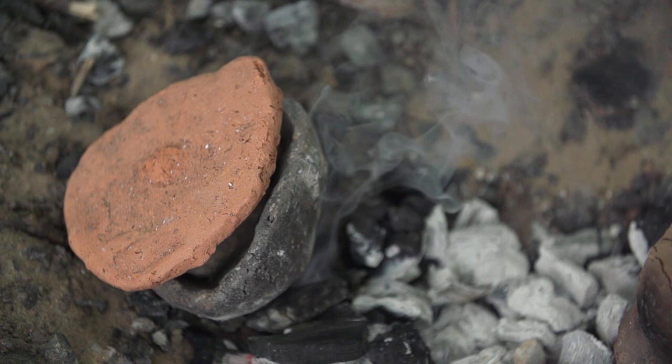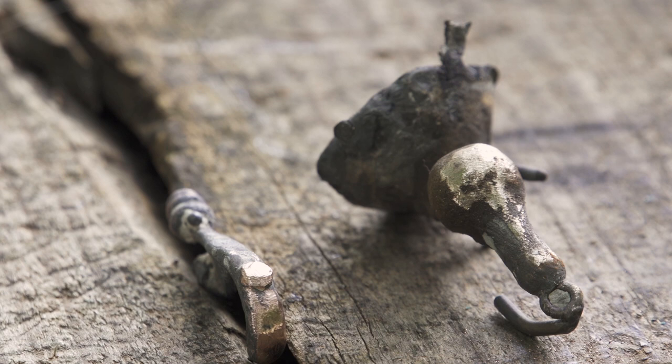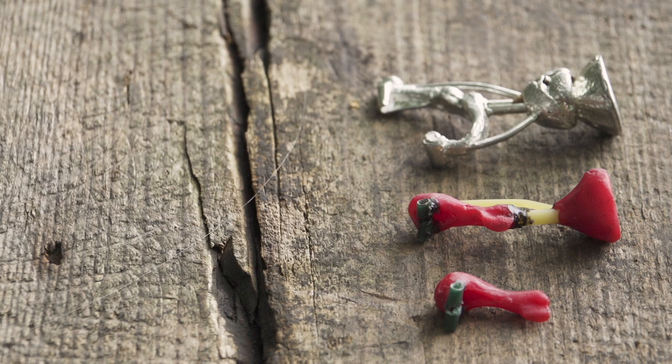This is a very small furnace with small crucibles. But even in the Iron Age they did make larger crucibles and had larger production. Once we broke open the mold, you can see the brooch itself, but then there are all these wires that come off — used to feed the metal to the different parts of the brooch. These are called sprues. You also need one at the top and one at the bottom, because air needs to move out of the mold. If you just had metal going straight in, there might be an air pocket at the bottom and you'd have an incomplete casting. By having multiple sprues, you ensure the metal fills the mold entirely and comes back up to the top.